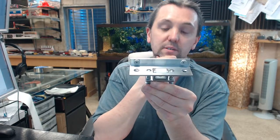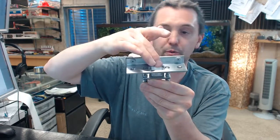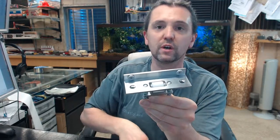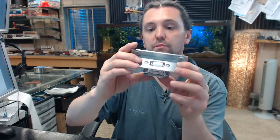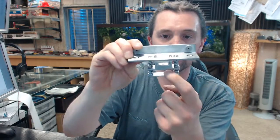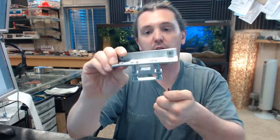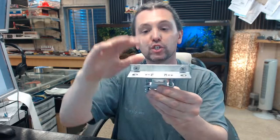Using a router would be the preferred tool for doing this. If you had one to do and no router, you would probably be chiseling by hand. This is adjustable, and I like the Rockwood design quite a bit because you can turn these screws to tailor the projection of the roller latch — loosening or increasing the tension and the force it takes to pull over that roller latch to get the door open and closed. When you tighten the two adjusting screws you decrease the distance between the two plates, forcing more compression on the spring, which forces the roller latch out more, but there is still enough spring power that it will push back down when you loosen it.